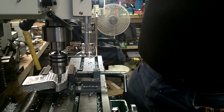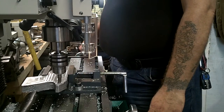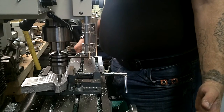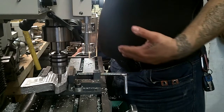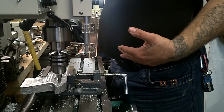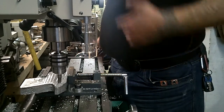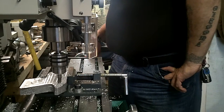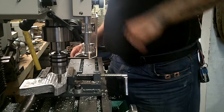Got the mill going at about 1500 RPMs and I'm just taking my time going real slow. Last time I was taking lots off to get down to size, but now that I'm getting down to size I gotta start going a little slower so I can start making better passes. My tool marks will be a lot smaller — all the cutting circles will be much smaller and much easier to clean up.